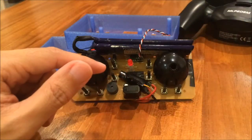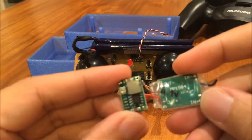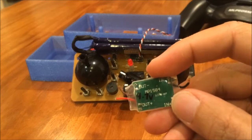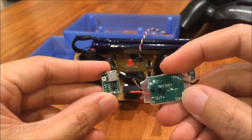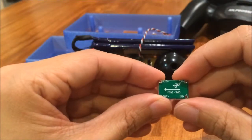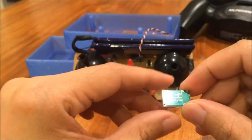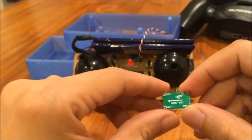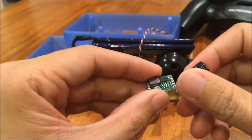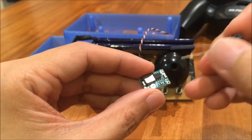The regulator here is actually the smaller version of the original MP1584 from Banggood.com. I still prefer the MP1584 although it is bigger, because the output voltage is really stable. This smaller one fluctuates up and down, and when using it for RF it's going to induce noise which will reduce the radio range. To curb that issue I put a 1000µF 6.3-volt capacitor on the output leads, and after that I do get very stable voltage.